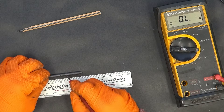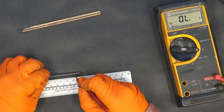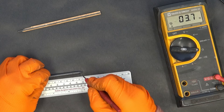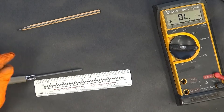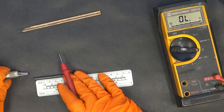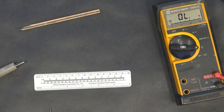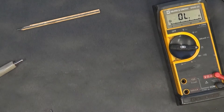At five centimeters there's five ohms. It is going up but not very much. At six, and at seven I'm going to run out of room. So this larger diameter would be a heavier weighted, heavier wattage resistor. Anyway, that's a look at graphite resistance versus distance.